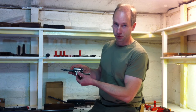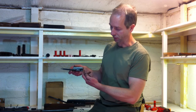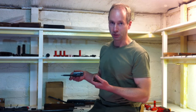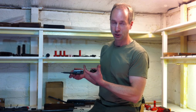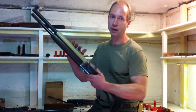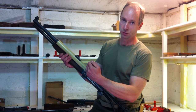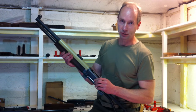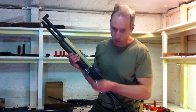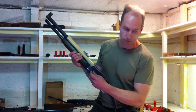hold the bolt in a bolt hold open position, they get some wear too, so that the bolt face is moving a little bit to the front. So these both kinds of wear cancel each other out, so that the length of your ejection port stays the same. But my handguard was so fitted that the barrel was moving back in the original position, like when the guns come from the factory. And suddenly my ejection port was too short. The ejection port is not that opening in the receiver. The actual ejection port is that front edge of the barrel and your bolt face.